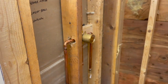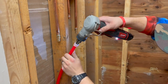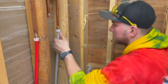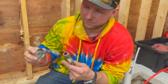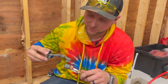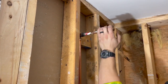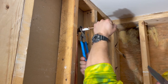I'm going to install the plug where my shower head's going to go and put pipe dope around it to make sure I have no leaks. That just goes right in here, like so. I'll tighten it with my pliers — I don't have to go crazy with tightening this. That should be good.